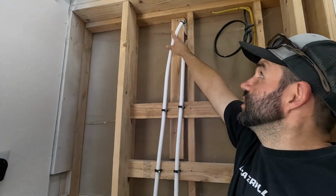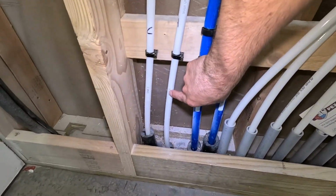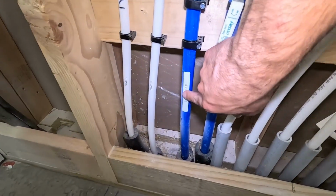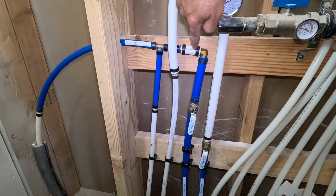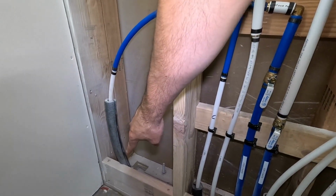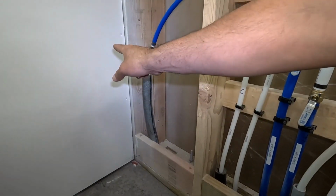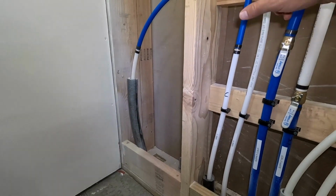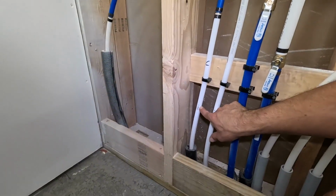I've got a 6-gallon water heater in there, and then it comes out of the water heater and goes down into, this is called sink hot, which we'll get to in a second. The cold comes through, another shut off. I convert from 3/4 down to 1/2 inch. This one's going to the toilet. I had to set these in the concrete before the concrete was poured. I don't have any lines in the outside wall of the shop, and that's just another freeze-proof thing. So I have one going to the toilet and one going through to sink cold.